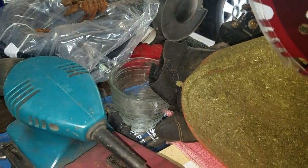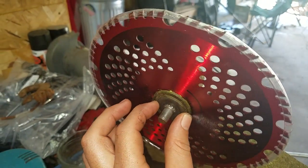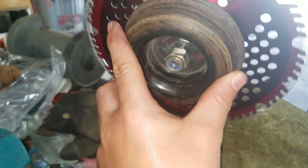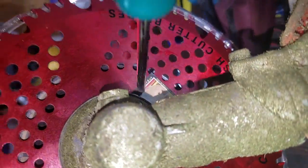Slide it on and as you can see that hole fits right on that shaft there once you remove that plate. Next, put this plate under the drive shaft, then put your spacer — that's part of your brush blade kit — and then the nut on. Once it's on there, tighten that bolt on the bottom with the tool that came with it. When you're tightening it, make sure you put your screwdriver in the hole in the back so that it holds the drive shaft from moving.